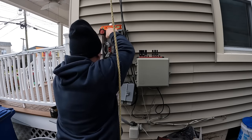So once the butt splice is on together there, I wrap it around maybe 2 or 3 times with this rubber splicing tape. It's rather expensive, especially now. But you got to have this to make the splice work. And the shame of it is that JCP&L, in a couple of weeks when they come back to resplice this, they're going to cut that out. And I think each one of these butt splices is about $12, or maybe a little bit less, but they're expensive. But it's very easy to make this connection up on the ladder, and that's why I like to use them. It's a shame that they go right in the trash a couple of weeks later, but that's out of my control. These are the rules governed by the utility company, and we have to abide by them and the National Electric Code.